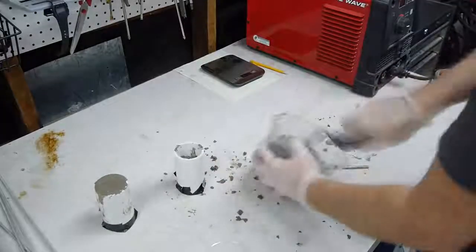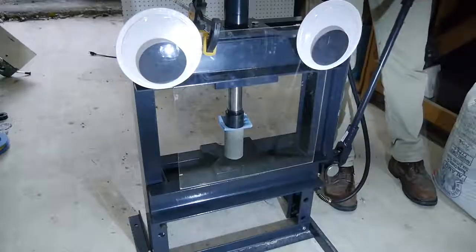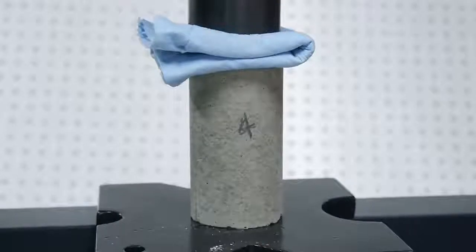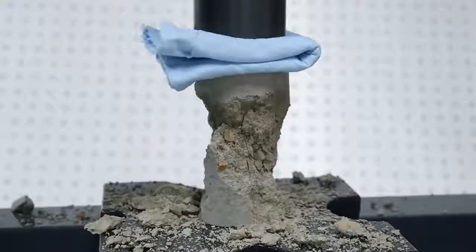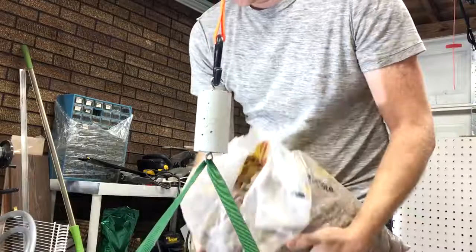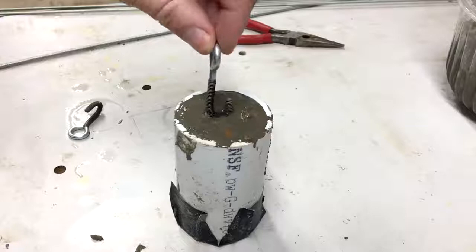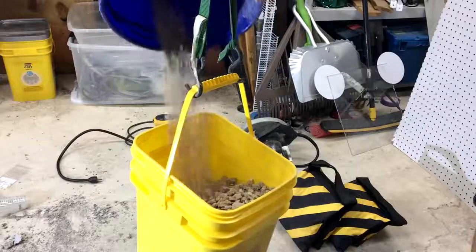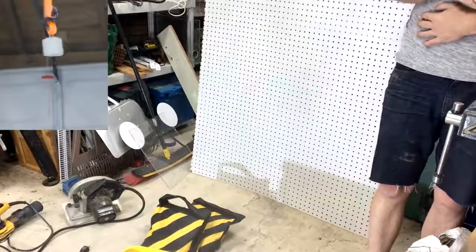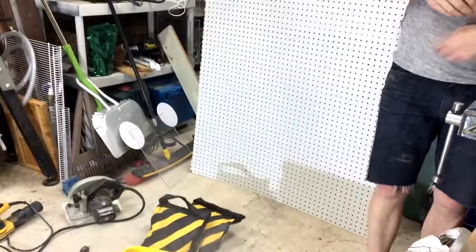These two concrete cylinders were cast from the exact same batch, and we'll see just how much load they can withstand before failure. Under compression, the cylinder broke at a load of about a thousand pounds — that's 450 kilos. That's pretty low because I included a lot of water in this mix. For the tensile test, I cast some eye bolts into the sample and hung it from the rafters in the shop. I filled up a bucket with gravel, but it wasn't quite enough weight to fail the sample, so I added a dumbbell to push it over the edge. The weight of the bucket was only about 80 pounds, or 36 kilos — that's less than 10% of the compressive strength.